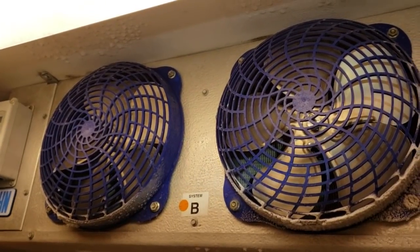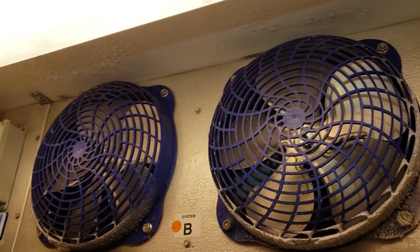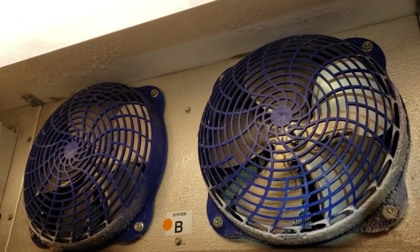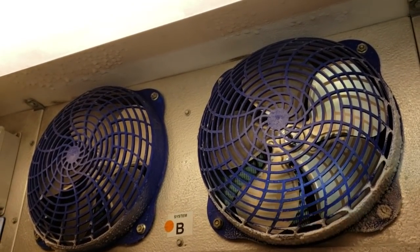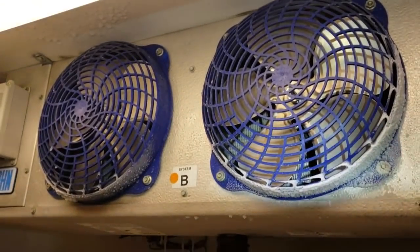This is actually a couple days later. I went ahead and replaced both motors because I had a burning smell in both of them. After changing them I got to thinking — what would cause both motors to fail? As long as they were getting proper voltage, the only thing it could be was the limit switch, the fan delay. So I bypassed the fan delay and I'm back today to replace the fan delay and the defrost termination. When I work on walk-in freezers and have to change the limit switches, I usually change those two together.